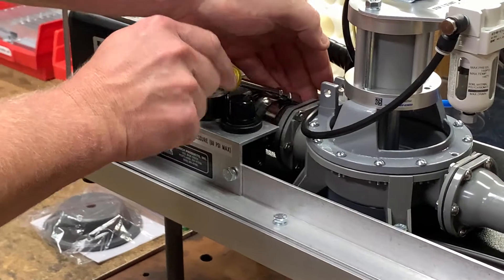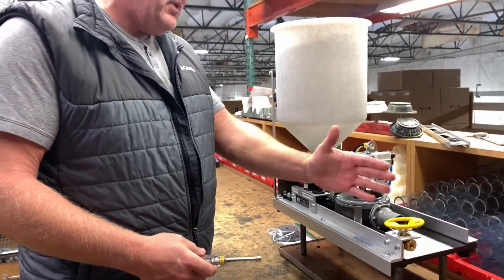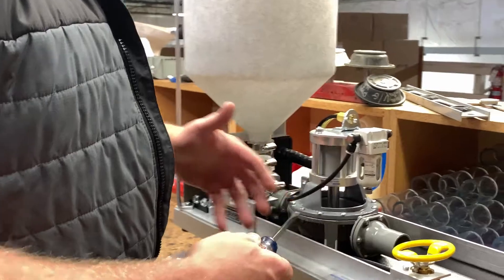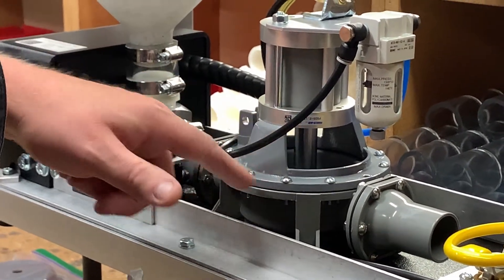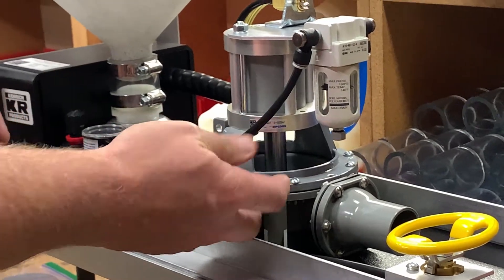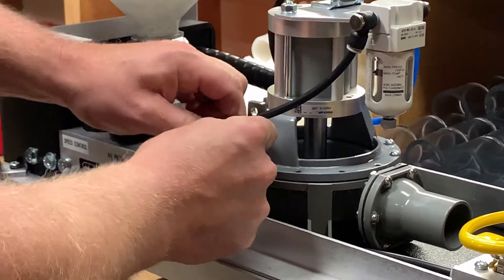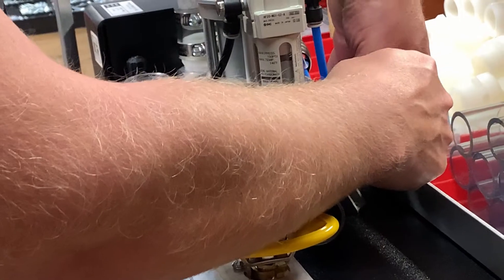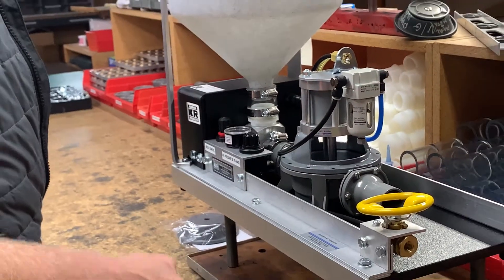You want to loosen that clamp up and slide it back, which will allow you to take the pump body off to change the flapper valve. With your flathead screwdriver — for the sake of time I've already done it — on this pump we do have ten slotted-head screws, just like on our ones and twos. Drop all the nuts and take out all the screws. If you lose any hardware or it strips out, we have everything here in stock at Kenrich Products — just call in and order over the phone.